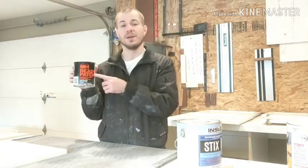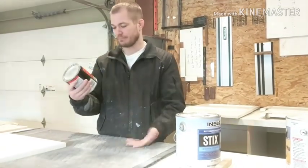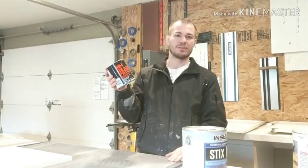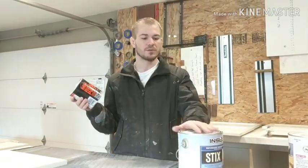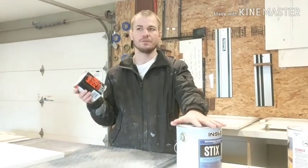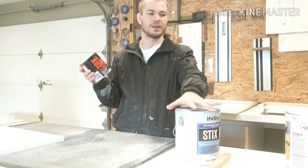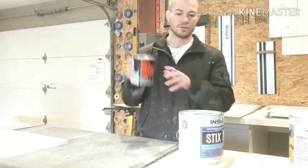You're going to see some big voids occasionally. In between the second and third coat — so after two coats of the bonding primer — you can use MH Ready Patch, which is a spackling compound. This is awesome. If you don't have it, Crawford's works too. Don't use the really cheap ones from Home Depot. With paints, it's very important to get a good quality brand if you want a good quality product. So this spackling goes on in between the second and third coat.